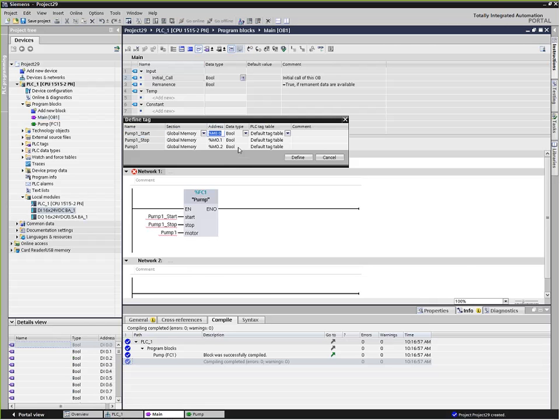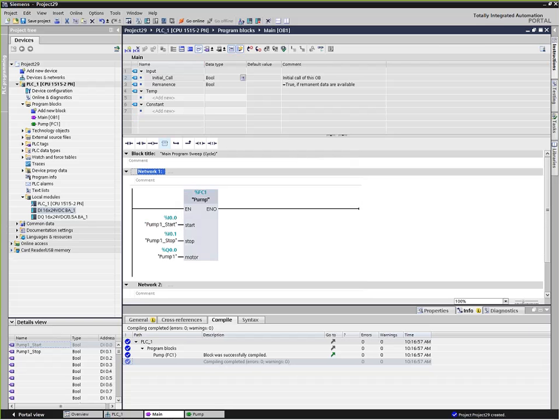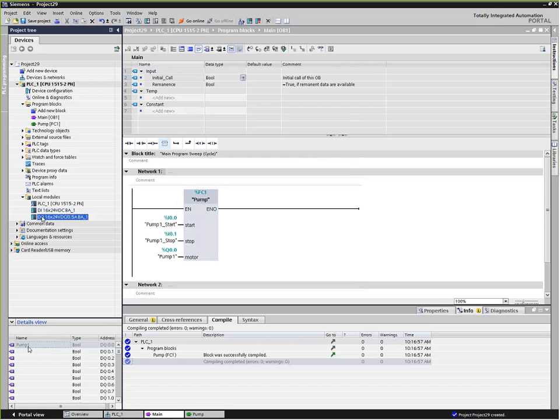the first one's going to be input 0.0. That's the input address for the first byte and the first bit on the first module. So I'm going to say I0.0 and then say I0.1 for the second input point, and then the pump, remember, is an output, so we call that a Q0.0, and then I hit define. We notice down here, now we see actually the definitions have shown up in our input module, also in our output, and I should be able to go over here and look at my PLC,